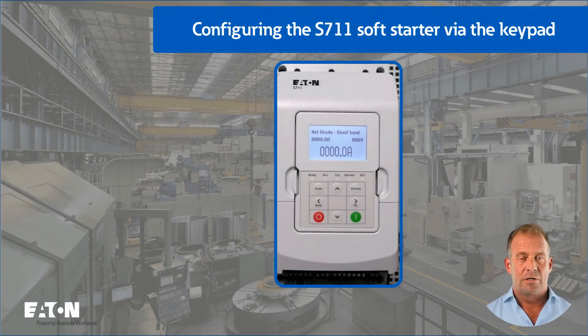When the controller supply voltage is applied, the factory-set monitor display appears after a short time, showing the device status. The current value for the mains voltage is zero, as no voltage is yet applied to the device. The ready LED flashes as the device is not yet enabled.